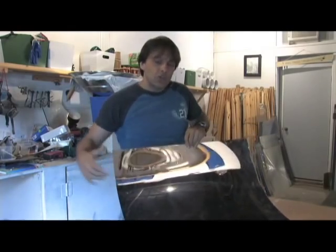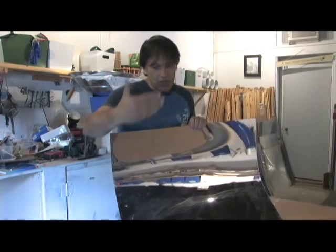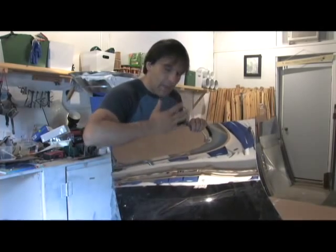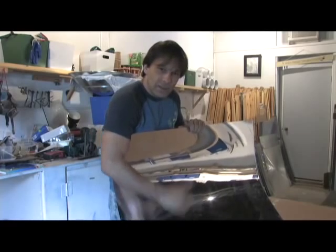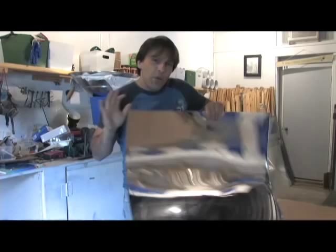Most cases people use a pipe and a mirror like this to shine sunlight to the backside of the pipe, so you get sunlight hitting the top of the pipe and this entire surface area concentrates it to one spot, which creates a lot of heat. The trough mirror we're making today is much smaller but will increase the temperature of the water in the pipe to about 160-170 degrees. It's a great alternative for heating water for a swimming pool or inside your house.